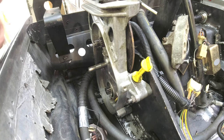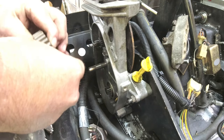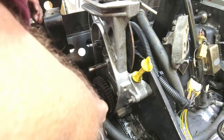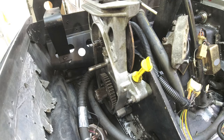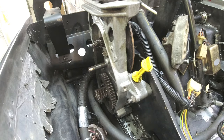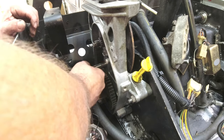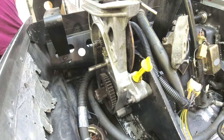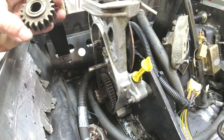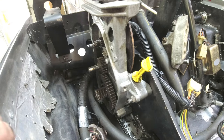Next it's that inner gear and the sleeve. The dogs go out. Let's get that on, and then we're going to start thinking about how we get that chain on. The chain's a little complicated because it's got to go on these gears, this gear, and the top gear all at once. Actually, it only has to go on the inner gear here on this mid-shaft. We're going to stick a thrust washer in there, and then select the one that's the chain profile, not the involute gear profile — you can tell just by the shape. The chain profile matches the shape of the chain gears.